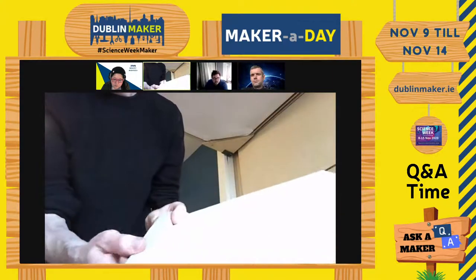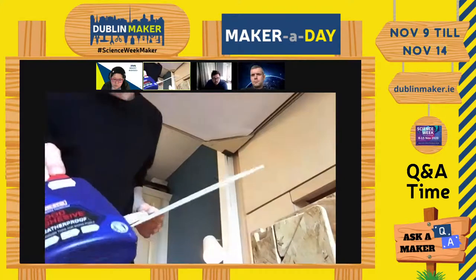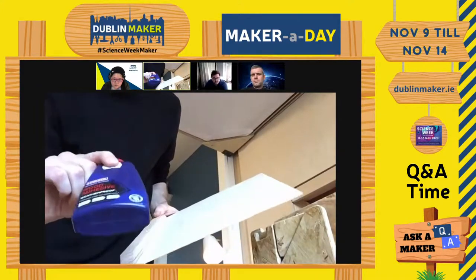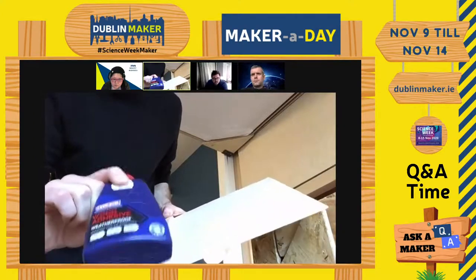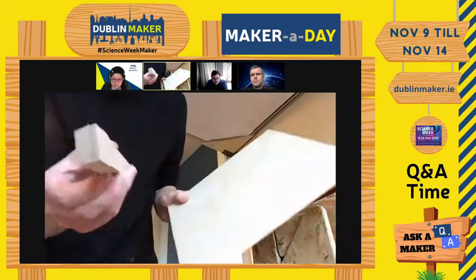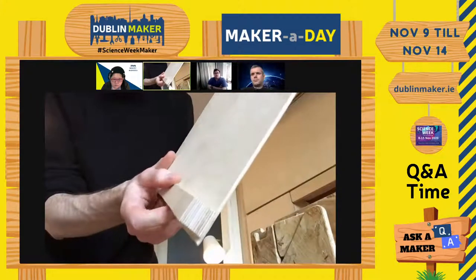And as I said, the wood glue, like the one I have here, which is just the stuff you pick up from your hardware store, if you get a good fixing and there's no dust in there, and like I said, you would probably rub it down with rubbing alcohol so there's no dust again and let it dry off. But that is as good a finish as you'll ever get, because plywood is essentially made up of the same stuff. So you're essentially making more plywood, making more plies with glue.